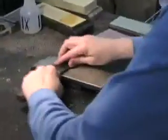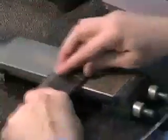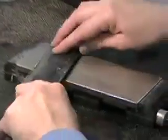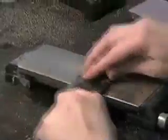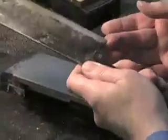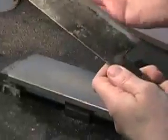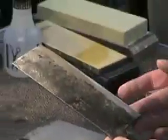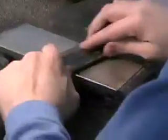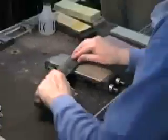How much of a burr do you raise? Like just enough that you can feel it all the way across? Yeah, you try to do it as minimum as possible, especially on these coarser stones. But when it's a new knife, sometimes you gotta go there. You gotta raise something. I'm gonna pass this around in a second so you can feel this burr. It's fairly significant, and it probably scares some of you because you're like, I'll never do that with my knife.